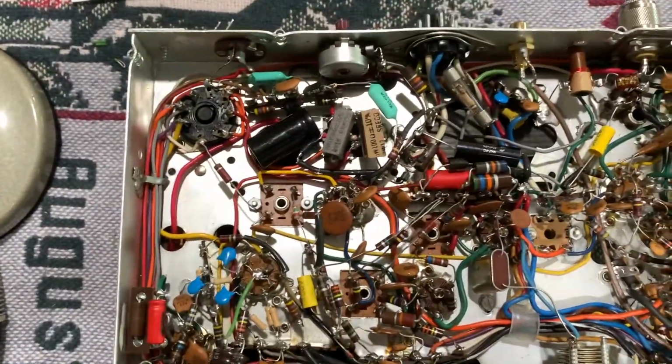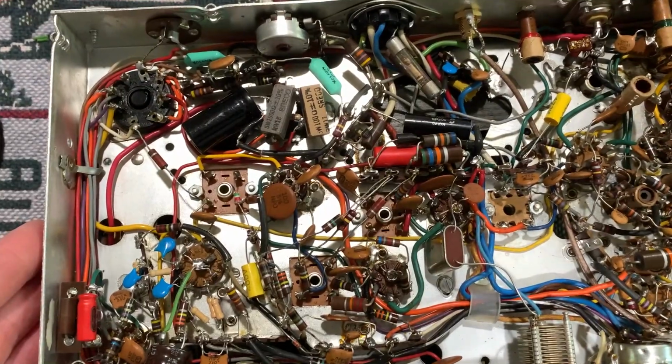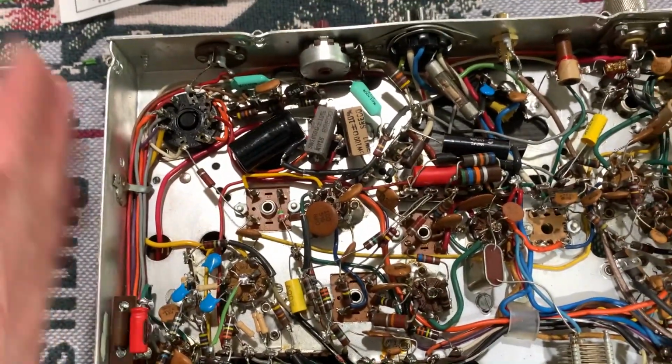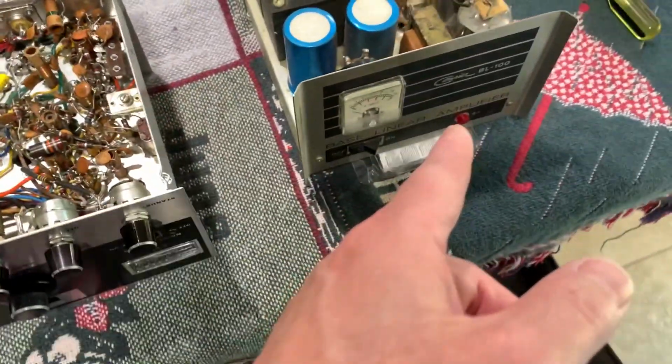That's the last thing I need to do to this transceiver, and I'm just going to go through and line the receiver and the IF completely, and then I'm going to try the 6CW5 tube in there, to try to get more power in the amp. It may not need it before it's over.